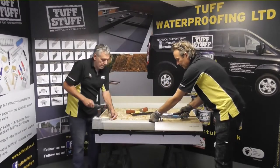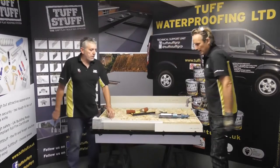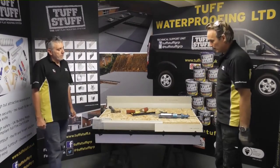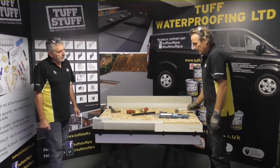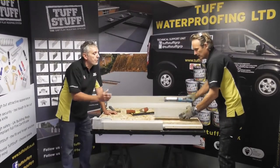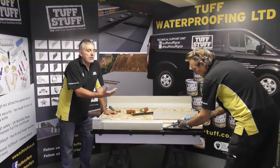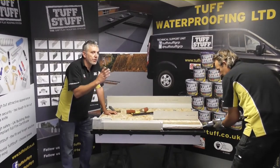Because the worst thing is if it's not straight, it looks horrible afterwards. So we can put the second bit in — trim adhesive between the two lengths of trim. And when we've laminated over this joint later on and used the tissue bandage, it's going to be a very nice smooth joint, so it's not going to stand out.